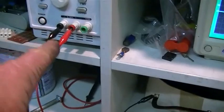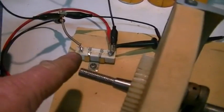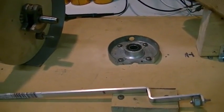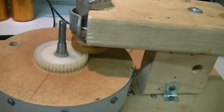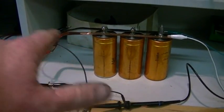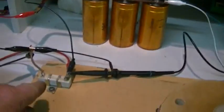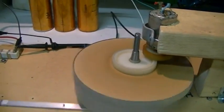I've now got the CVR between our power supply and our cap bank, which smooths things right out on the scope. I also have my DMM across that CVR so we can see if it's reading roughly what our scope is telling us. I'll go ahead, put it together, give it a run up and see how we go. Everything else is the same as the last test. The CVR is now between the power supply and the caps rather than between the cap and the motor. We're ready to get our baseline measurement at four volts input.